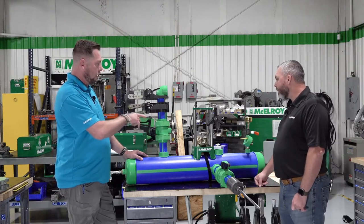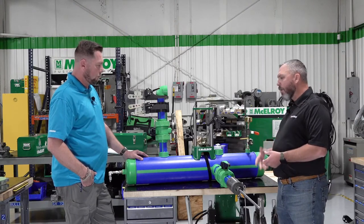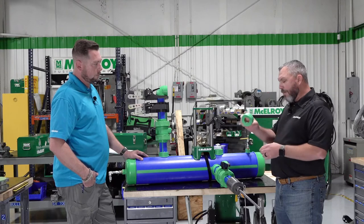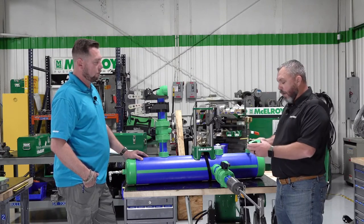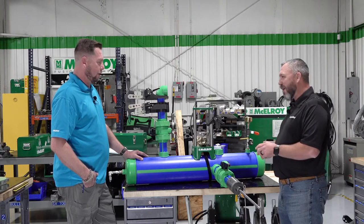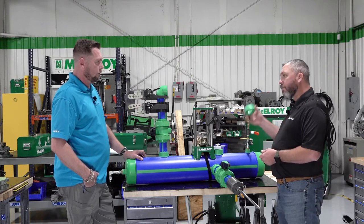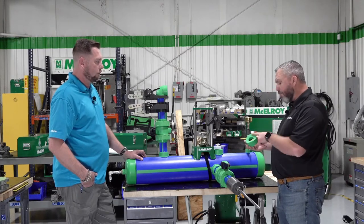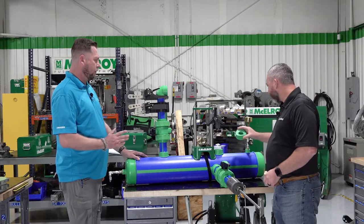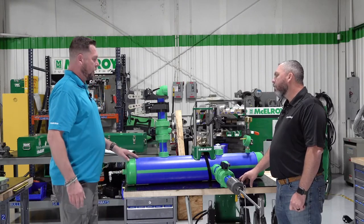We've got some other tooling here. We'll use the Hornet to start the whole process. On a pressurized line where we don't want to disrupt service, we want to add a service line. Those not new to polypropylene have seen something similar — an outlet with a pin where you drill a hole. But with a pressurized system you don't want to do that. So what we have is a saddle fitting. We use the Hornet to attach the saddle fitting to the crown of the pipe, melting the surface area and fusing them together just like any other fusion.